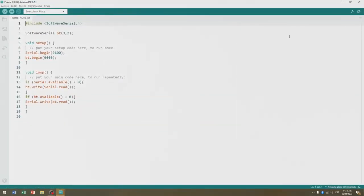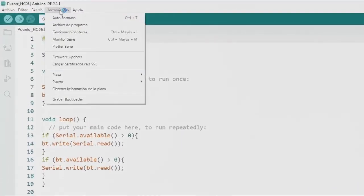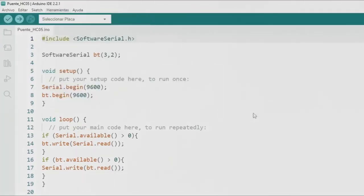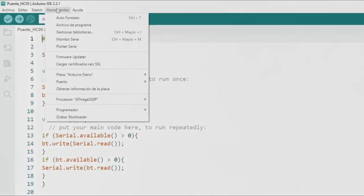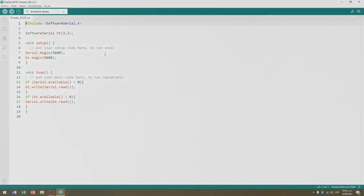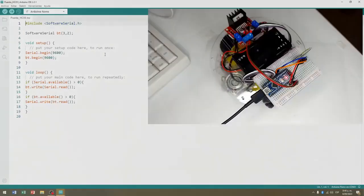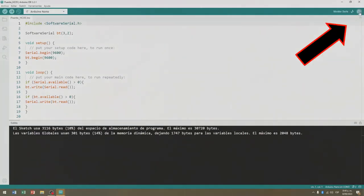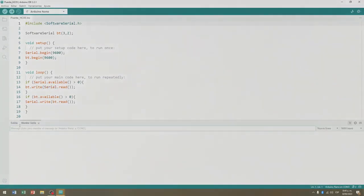I leave you this Arduino bridge code in the description of this video in case you require it. We go to Tools, Board, and select the board we are using, in my case the Nano board compatible with Arduino. We go to Tools, Port, and select the port to which our board is connected, in my case COM3. We click on Upload, and we upload this program to the board. We open the serial monitor tool of our Arduino software.